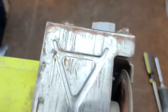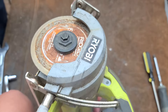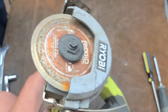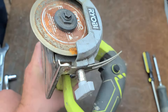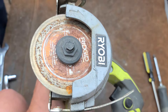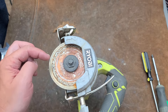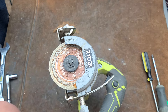There's really just not very much scuffing on the base plate here. Wet-dry tile saws — this happens to be a four-inch, but it does turn out that there is just enough clearance to actually put a four and a half inch blade. It uses a standard five-eighths arbor. With about a millimeter of clearance you can put on a four and a half inch blade, and the reason you'd want to do that is many times countertops are actually 30 millimeters — one and a quarter inches thick — and you need just a little bit more depth of cut than what the four-inch blade would offer in those certain situations.